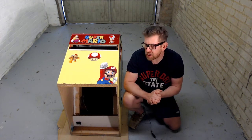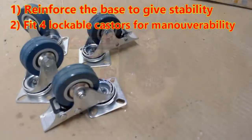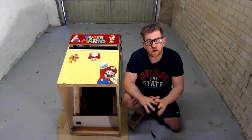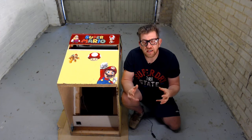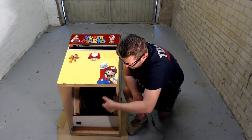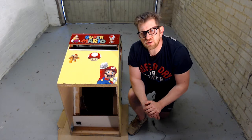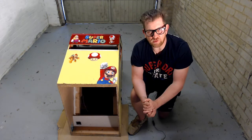What I plan on doing is reinforcing the bottom and putting four casters on it — lockable casters — so you can put it into position, lock it in place, and that will stop it moving. While this video doesn't cover the working of the pusher, it does give you an insight into how you can make it more maneuverable at home. I'm going to run some wood across to reinforce the base and give it something solid to attach the casters to. The casters support up to 200 kilos of weight, so they should be ample for what we need.